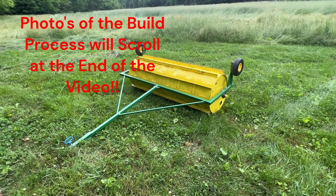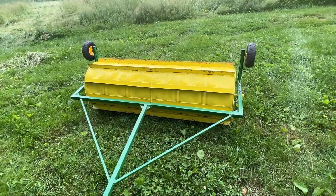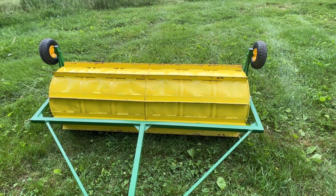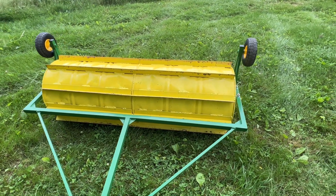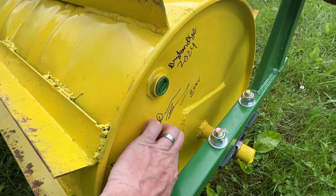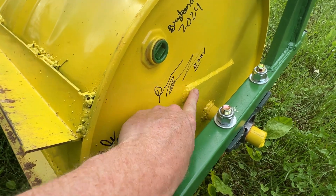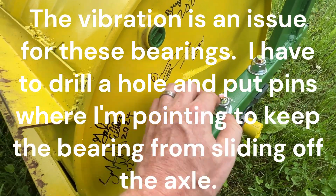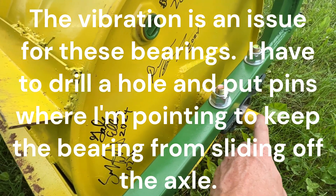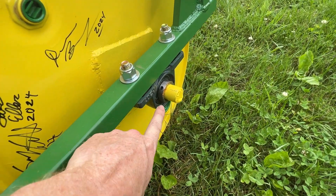Here's the crimper I was able to build over the last couple months. I started with just two 55-gallon drums — I made sure they had the ends on each side so we could weld them straight down the center together. We found the actual center of each barrel and welded another piece on to make the metal stronger. These barrels are very thin metal, so we welded a piece on each side, blew a hole in each side, and ran a one-and-three-eighths inch rod all the way through the center.